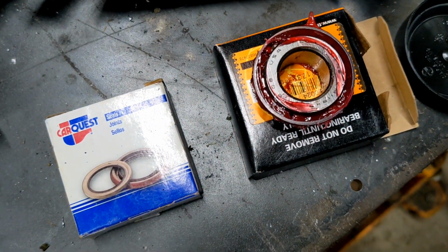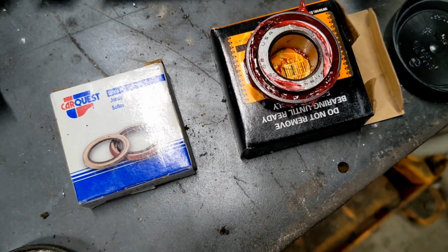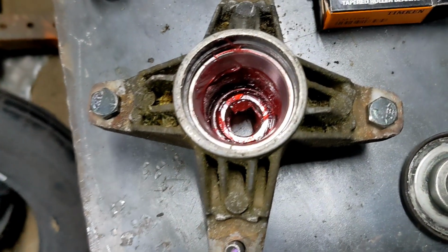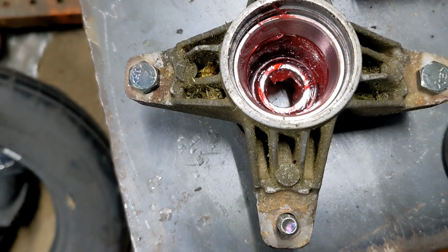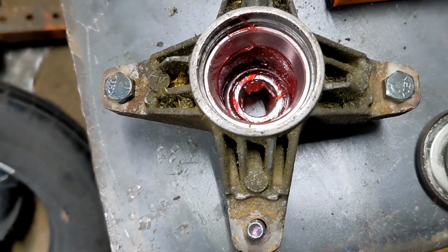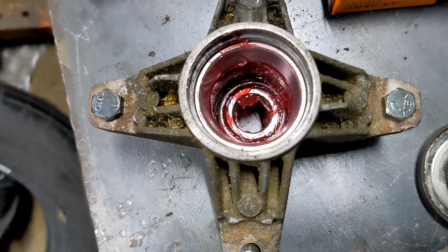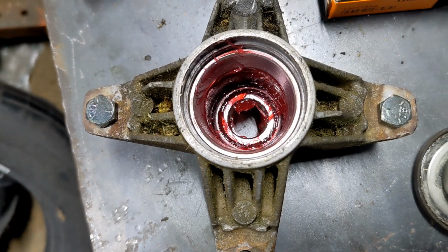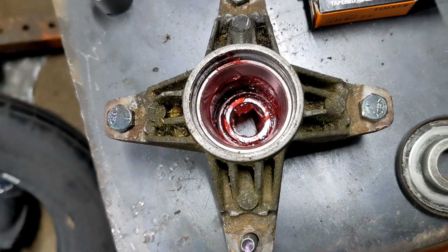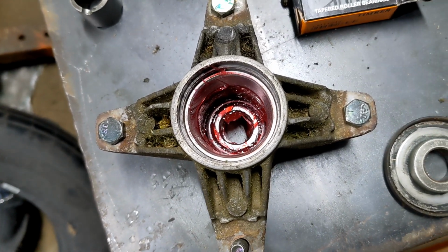And like I said, I've just packed the bearings. I use like a red tacky grease, same thing for wheel bearings, and this, all the same. So put a little bit of grease in there, just on the surfaces. It honestly looks like it's probably more than it is, but it gets pumped full anyway. You're going to put 5 or 10 pumps of grease into this and then let it run. You're putting some grease in there so it doesn't take you 100 pumps to get anything in it. You don't want to over grease it, but you certainly don't want them running dry.